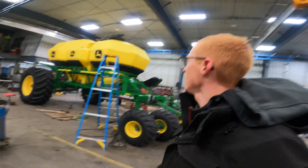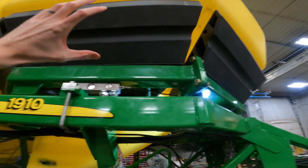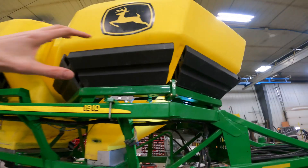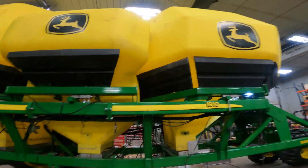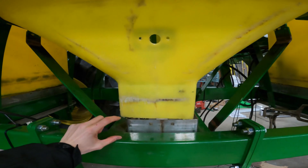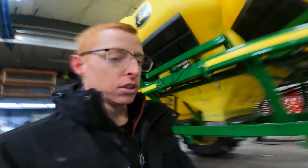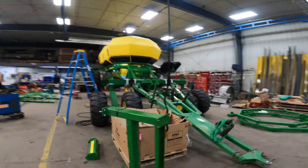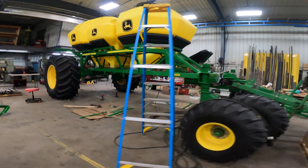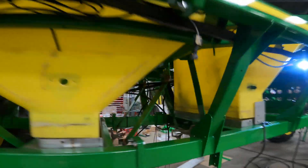Let's take a look at what they've got done here. It looks like they got the cradles up here. We had to lift up all the tanks and put a separate substructure on here so we could get the scales in and get a proper measurement. They've got all three of those in. They're working on the transition pieces down here — that's a challenge because when the tank gets pulled up out of here you can't have any air gaps. The frame can't be touching the tank in a way that would affect the weight measurement. There are a few little hiccups, but that's what happens with R&D, so they're doing some modifications to get those fixed.